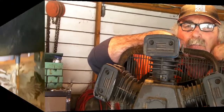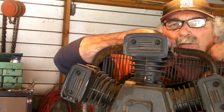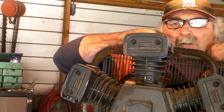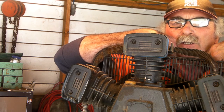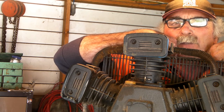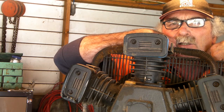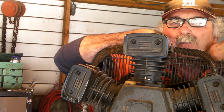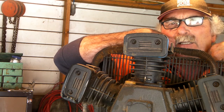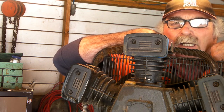So that's about it really — as simple as one, two, three. Just drain the water and you won't have any issues. Do it at least once a week and you won't have to go and buy yourself a new tank. This is a 20-gallon compressor — good for my workshop, three horsepower motor, about as big as you can run on single phase. I use it for spray painting, nail guns, staple guns, brad guns, and plasma cutting. Anyway guys, if you like my video, subscribe and drop me a note. Remember what I said about running these things on extension cords — I've got another video on that too. Catch you next time.